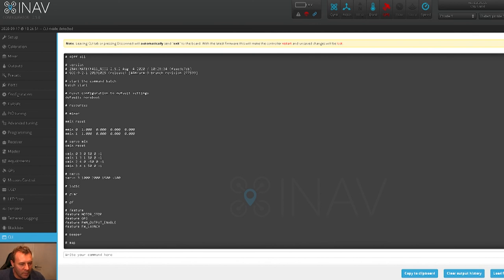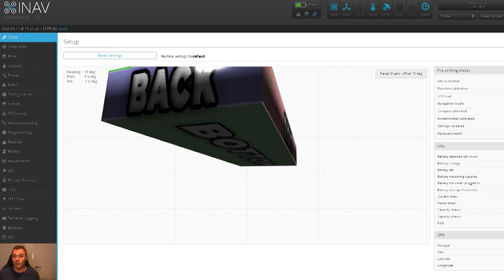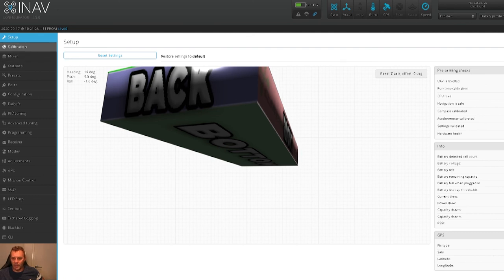There you go - that's giving you two backups now. If you need to restore any of your settings you just use these two files to paste into the CLI and save, and that'll give you back all your configurations and changes. I'm ready and confident it's going to perform pretty well. I'll take it outdoors eventually and do a double check when I've got GPS lock, just to make sure my angle mode and horizon mode self-leveling is all going the right way - that's very important because you don't want to be up in the air and find that's wrong. So that's pretty much it - next step will be to throw it in the air when I get some decent weather. Thanks for watching everyone, I hope you enjoyed that little tutorial and run-through. See you on the next video - have a good one, bye for now.